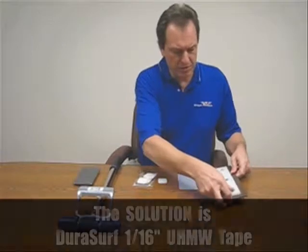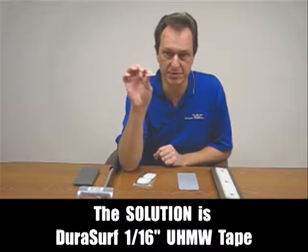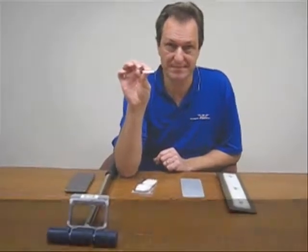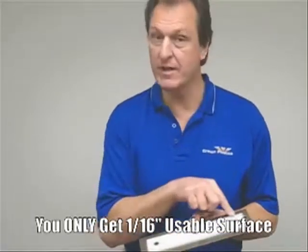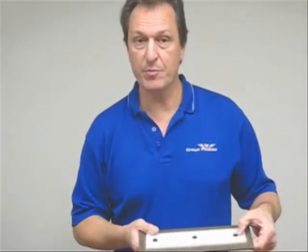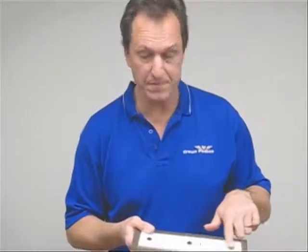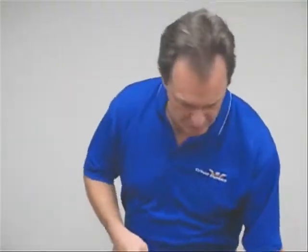What we're going to do is show you how you can virtually achieve the same objective with just a 1/16th UHMW tape. As we mentioned with the quarter inch sheet, if the product is installed properly, you only get 1/16th of an inch of usable wear surface — and that is if it's installed properly. As I've been out in the field and seen this product installed in various applications, in most cases they don't even have the bolts countersunk properly, where the bolts are just flush with the UHMW. So they're not even really getting much use of the quarter inch sheet at all.